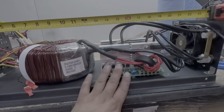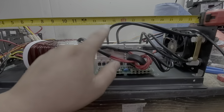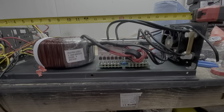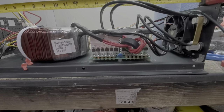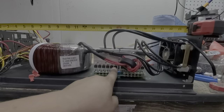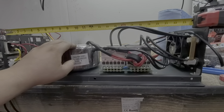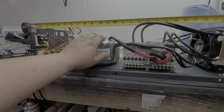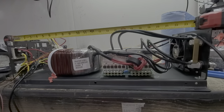You are going to be absolutely fine getting 5 kilowatts with this particular inverter — this will definitely handle 5 kilowatts and more. There is a possibility that we may design even our 12-volt inverters to have all these FETs, so you could theoretically upgrade your transformer to a larger one and not need to buy a bigger unit. I'll talk to Sid and Jack about that — it all depends on cost.